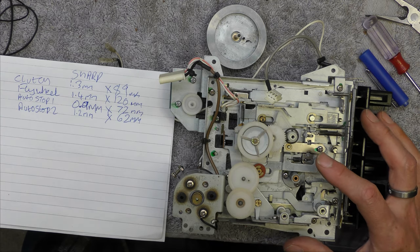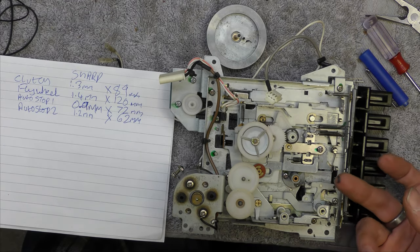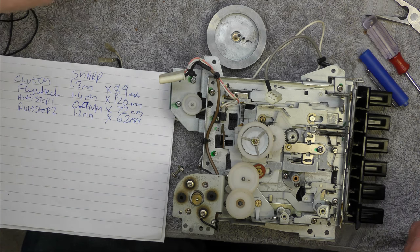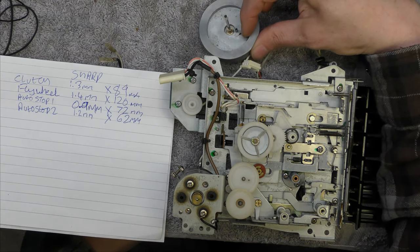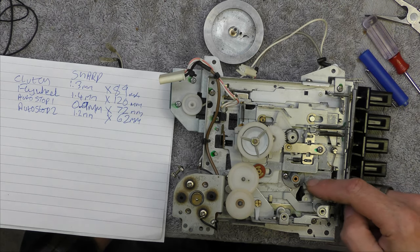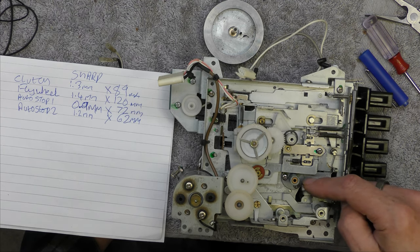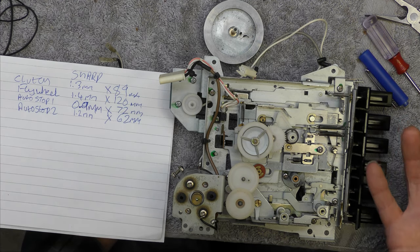There's still plenty of sticky material. Interestingly, the flywheel grease was still quite good so it wasn't too bad. There's a little pin for the auto-stop mechanism - that's what actually disengages the stop. Push that lever and it issues a stop. The only thing is it's one of those detectors that works before the pinch wheel, so if the tape gets stuck on the take-up spool you're going to have a tangle. But it's not too bad, and the piano keys part was definitely the worst.